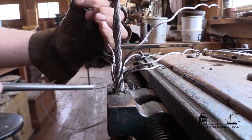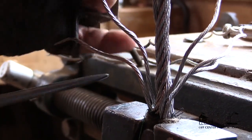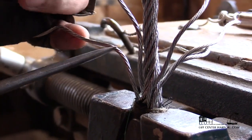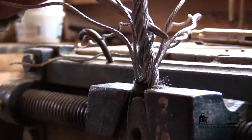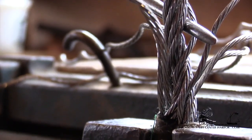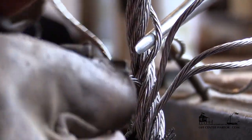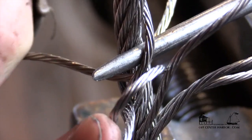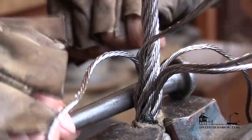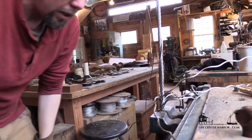We've got two left. There's only one strand left that hasn't been tucked under yet, and it's going to take both of these strands but they're going to go in opposite directions. This one is going to go right up under here, and this one is going to come and go back the other way. This one is fairly easy — it just sort of goes in there. Run that down in there. And this one is a little more of a doozy — it comes around and goes on top. Everything is in there nice and even.